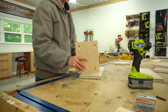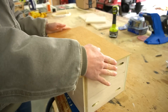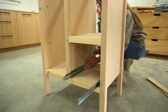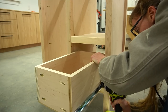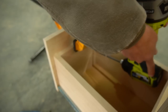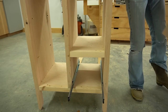I cut and assembled a simple drawer box using pocket holes and screws. Normally I cut dados to install my drawer bottom, but in this case, since this drawer was so small, I just stapled the bottom onto the box. Either way would work fine here — this was just a little quicker. Then I installed the drawer box onto the slides. For the drawer front, I positioned it so that the gaps were even around all the sides, held it tight while I pushed the drawer open from the backside, then clamped it in place while I drove the screws from the inside. Once the drawer was installed, I removed it from the cabinet using the tabs on the sides of the drawer slides so that it will be easier to finish in a later step.